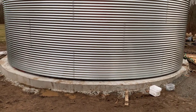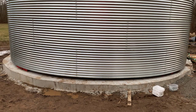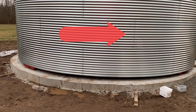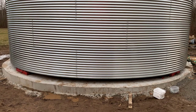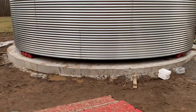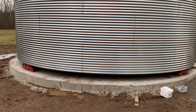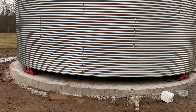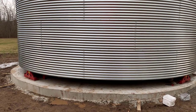Another job being done by the guys on the inside is putting pieces of tape down. When you look at the outside of the building you can see those strips of nuts and bolts lined up at the bottom all the way around — each single line of nuts and bolts has tape put in, and that tape is to make sure no moisture gets through those cracks into the building. Since we're using it for a house we're going to insulate on top of that later, but this is the first layer of keeping moisture out.